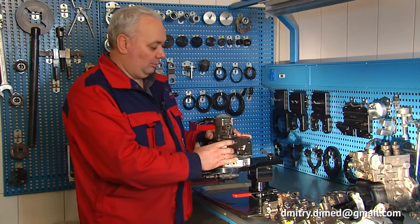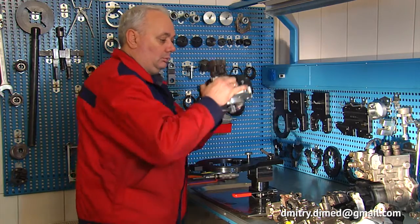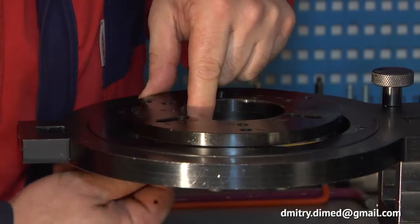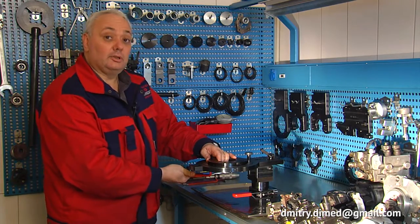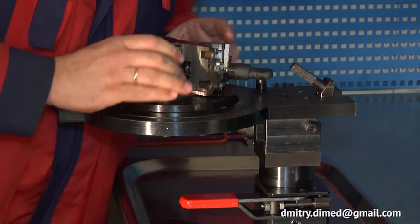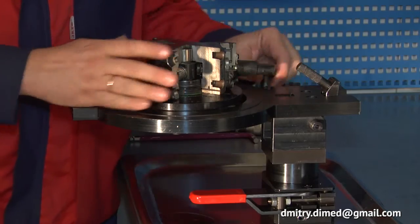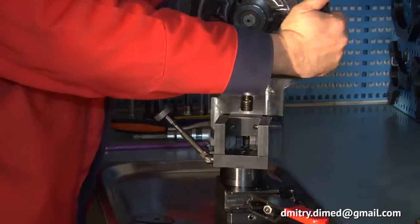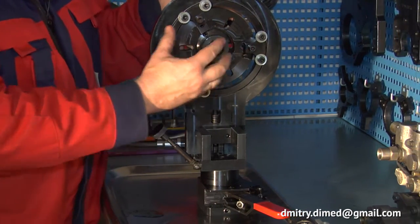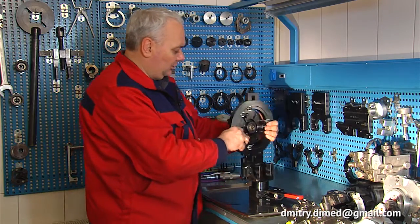If it is necessary to change from the larger Bosch pump CP 3.4 to the smallest CP 1 compact, you can do the following: install a suitable adapter flange, fix the adapter flange with three screws, and install the CP 1 compact pump. The adapter flange design is such that we can completely disassemble the pump without having to remove it from the clamping device. It is possible to remove the bearing cover and shaft through the hole in the adapter flange.